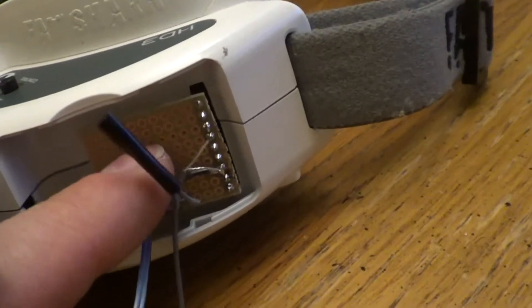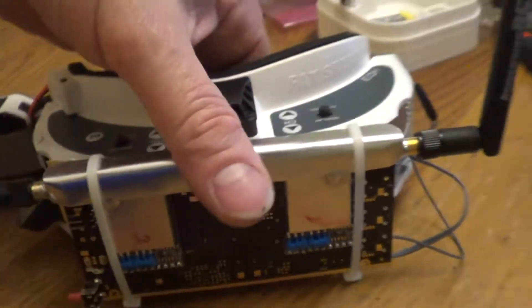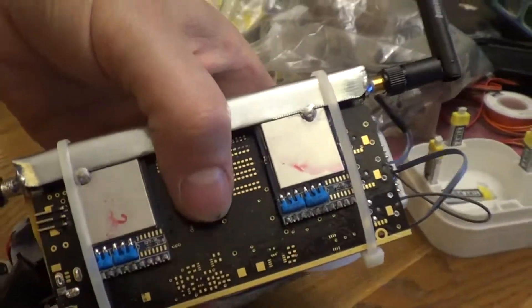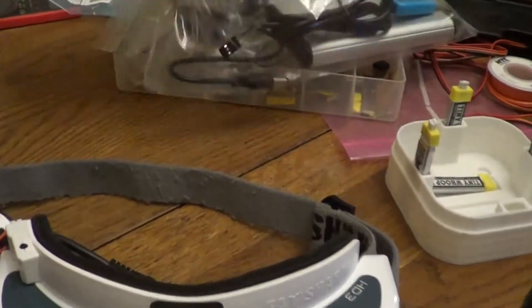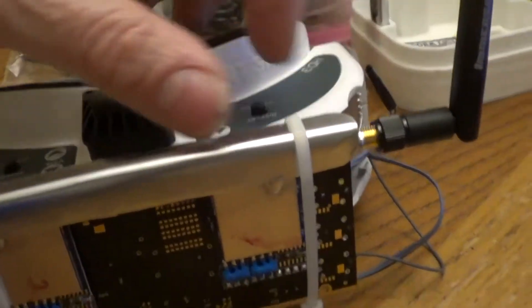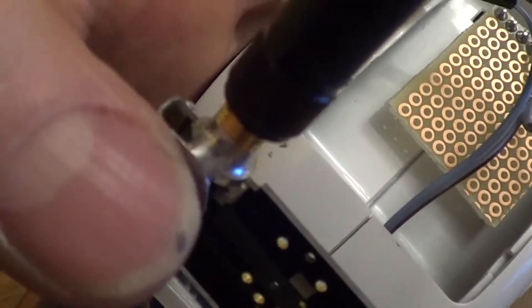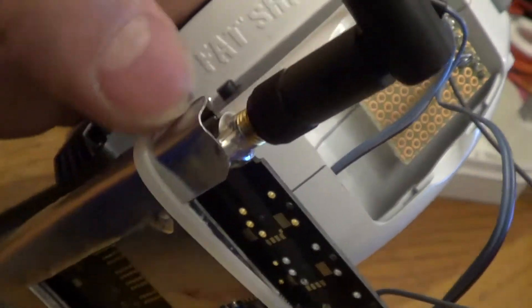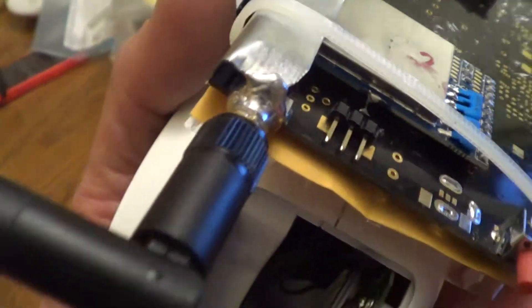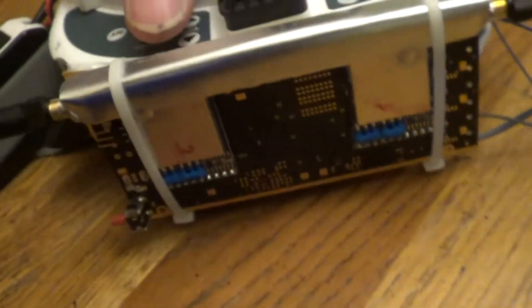I've got a little proto board here where I can add all the parts I need, so that when I turn off power it's going to turn off the ClearView. Something else that worked out pretty good is I stiffened the board, because I wanted to save weight. Rather than having this big clunky piece of aluminum hanging off my face, I just put a piece of sheet metal here — this is just galvanized, basically zinc-plated — and it really stiffened it up a lot. You've got to use a big soldering iron. I soldered it on the back side, ran a bead in the middle and on the other end, so I could probably drop this thing and not bust my $400 ClearView board.